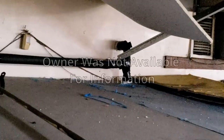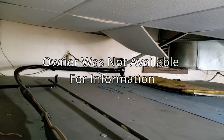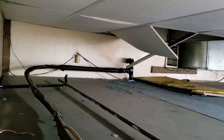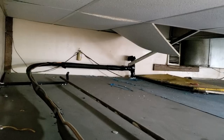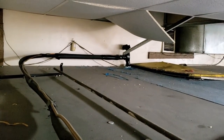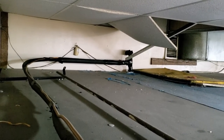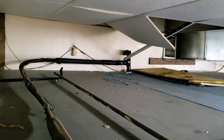It wasn't wanting to pump down, and since nobody has a clue about anything going on around here and nothing is labeled, this walk-in cooler is also on the circuit - that's why it was trying to run still. Now it's opening and closing like it should. I'm back to possibly replacing the thermostat - I'm going to go ahead and replace the thermostat and call it a day. Would have been great to have known that earlier.